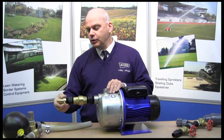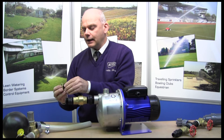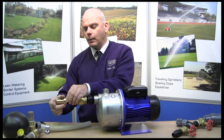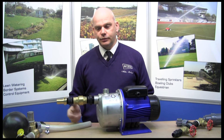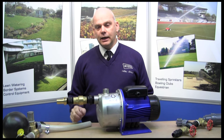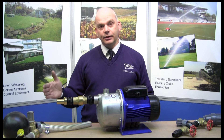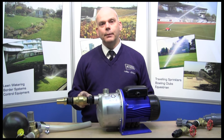That screws on there and the beauty of that — don't forget the seal inside — is that I can easily undo it. So I can bolt my pump down and then do this afterwards where it's in relation to the tank itself. So that is the first option — what's called a flooded inlet, a flooded head. We've got a tank alongside it and our check valve, most important.